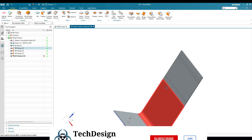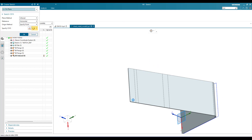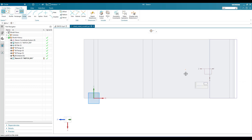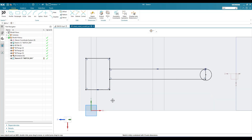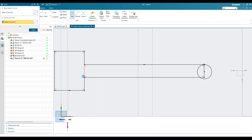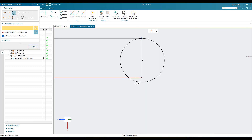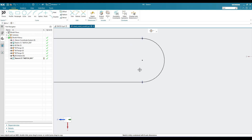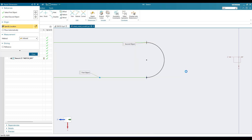On this flange we have to create a sketch. Go to sketch and select this particular plane, click okay. I'm going to draw one circle, one rectangle, and one more rectangle. There are some unnecessary lines, so press T to trim them. The remaining lines should be tangent to the circle — I've made them tangent. Now the diameter of the circle is 25 mm.